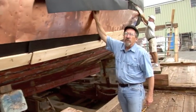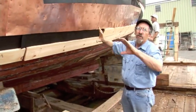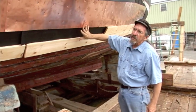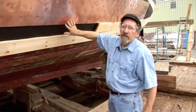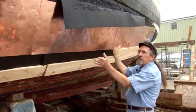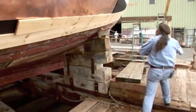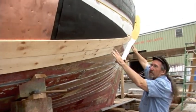It seems logical that when we put the copper sheets on, we start at the waterline and make everything parallel with the waterline. But with the shape of the boat it just doesn't work out that way. So what we have to do is determine a line below the turn of the bilge, which is called the gore line. And then we start to bring the copper up from there. And this will actually be a straight line, but as it bends around the boat, as you can see up in here, it's going to go above the waterline. And in those cases we have to cut a piece to fit up to that waterline.